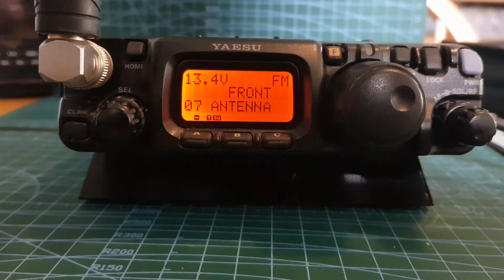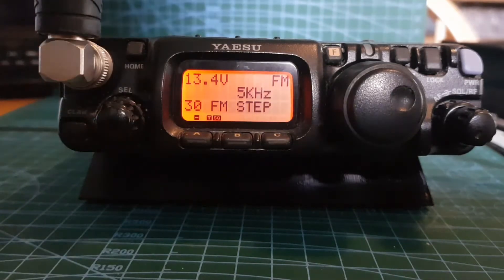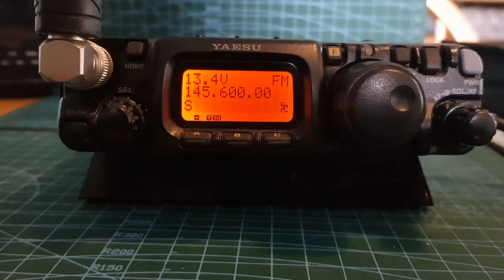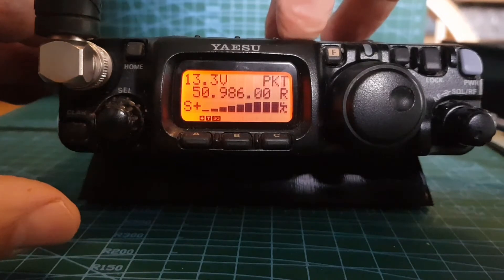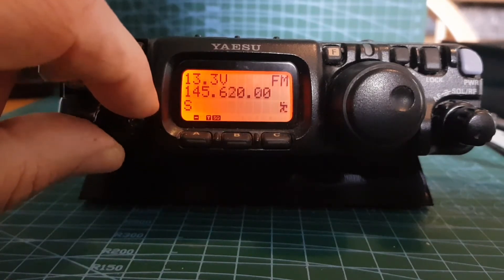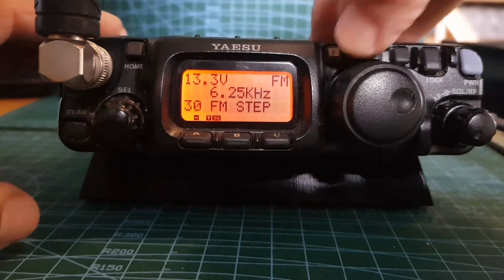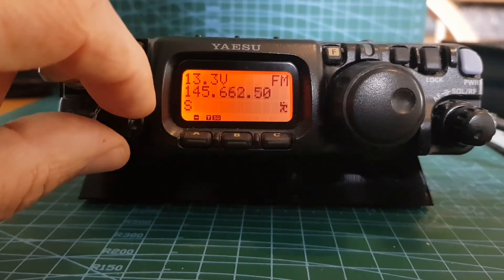While we're here, the step for FM is menu number 30. Turn to number 30 and you can change the step. If we're in VFO, put it on five. Going back to VFO, turning the knob, we can see we're in increments of 10. Hold down 30 and let's go to 6.25. Come out and look - you're in between frequencies, and you might need that when adding something like a repeater on an odd frequency.